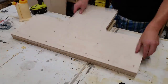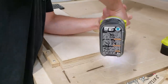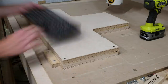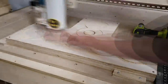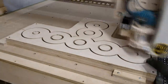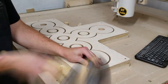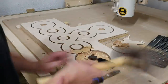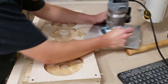The screw placement is a little different on this jaw — only the outside and three specific points in the middle, measured so the screws won't get hit by the router when carving out the gears. Over at my CNC I drill six holes to clamp it down to the table using 3 inch screws — the same hole locations I'll use later to attach the lexan to the front. I chose the CNC to only cut the perimeter and inside shapes rather than hog out every speck of material. I simply pop out the inner circles, chisel out the outer shapes by hand, then come back with my router to flush everything to its final depth. This saves bit life and was actually a stress reliever.